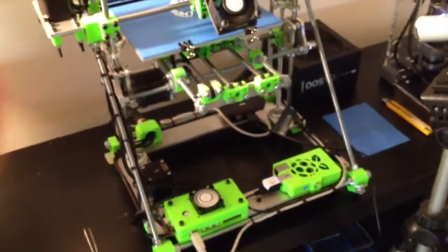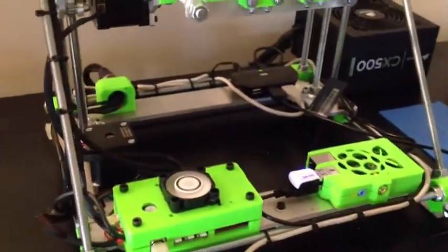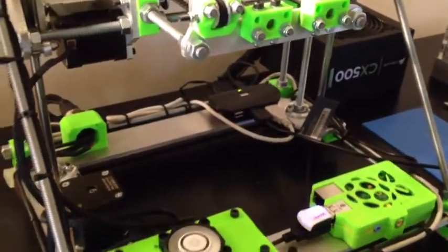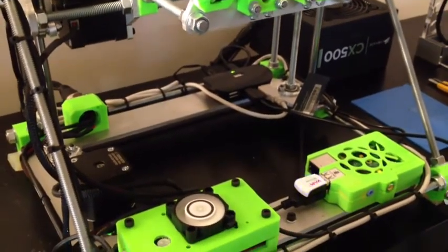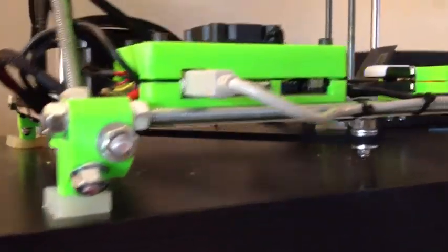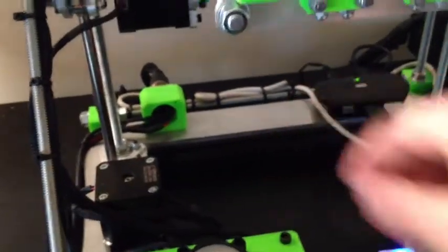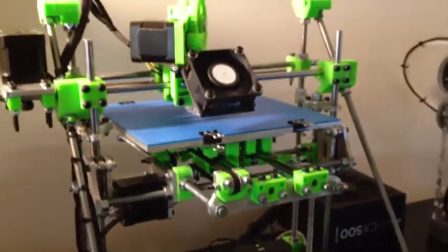On this printer I did it a little bit differently. I cut an extra brace in the front out of aluminum so I could run a different belt. I had a stock T5 belt from a Mendel — it was the only continuous one I had and it was quite a bit longer. So I put this plate on and then put an extra idler bearing up front, and the belt path is kind of more triangular, which seems to work just fine.